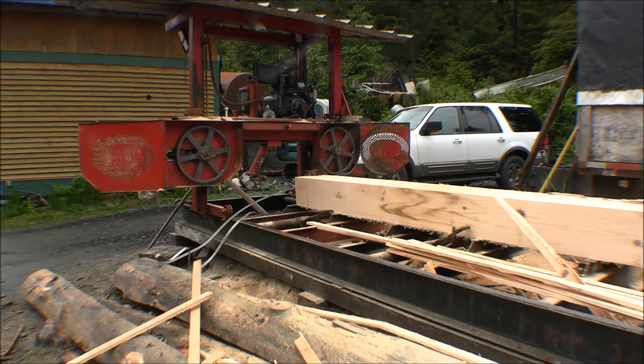disintegrated on me. Well, my blades are getting pretty worn out. I've used them a lot, got a lot of use out of them, and I made all these cuts on this one, cutting the rind off, breaking that log down, plus the 2 logs before that. Even though I pressure washed that, it's kind of through dirty wood, so that had a few cuts in it. I've sharpened these blades 5 or 6 times, so they're getting on the tired end of it. I look and check for any fractures in the gullets when I sharpen them, but you can't catch them all.